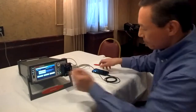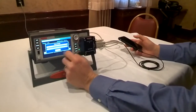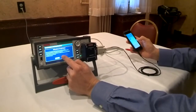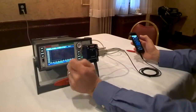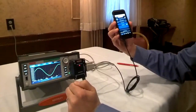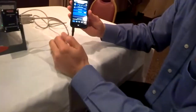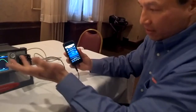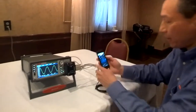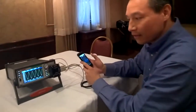What we've designed in this thing is a way to product demo this. I'm going to attach what I'm calling the microphone graph demo and go ahead and run that. Let me turn on my source. Now I'm using the digitizer in the DMM — this is a one mega sample per second, 18-bit digitizer, generating a sine wave with this application. Let's go up and change the frequency: now I'm running at 500 Hertz. You can clearly see that on there. Let's switch it now to a kilohertz — you can clearly see that on the DMM.